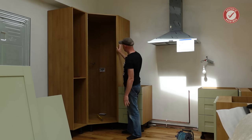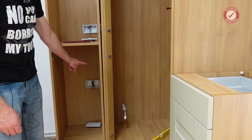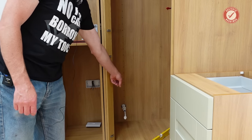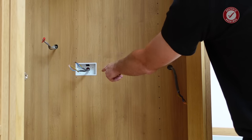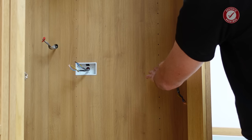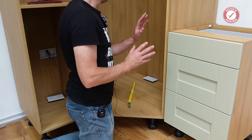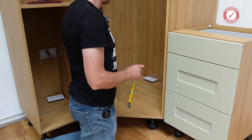That's in, and because this is the hardest thing to move we're going to use this as our reference point for everything. We've got the cutouts done for the electrics — this is going to be for the fridge power supply down here, this is going to be for a charging station inside the cupboard up here, and we've also got a cutout for the water supply for the fridge. Over on the other side of the cupboard we've got a socket potentially for a microwave. The cooker point is going to be on the right hand side and we've got a lighting point so we can potentially have lights in the cupboard. So lots of cutouts — very fiddly.